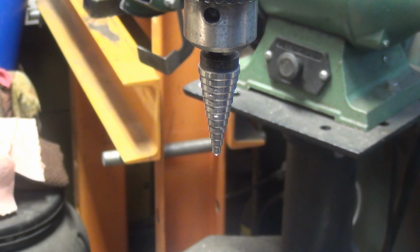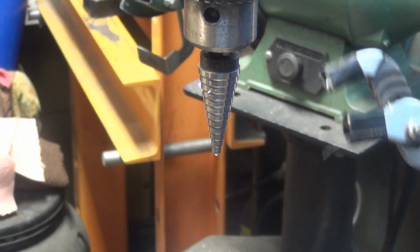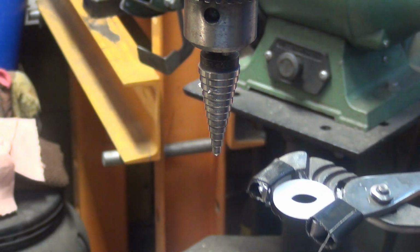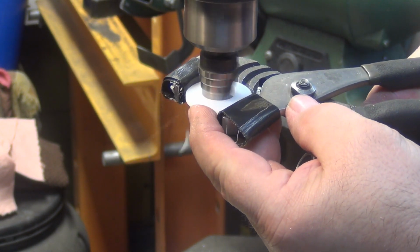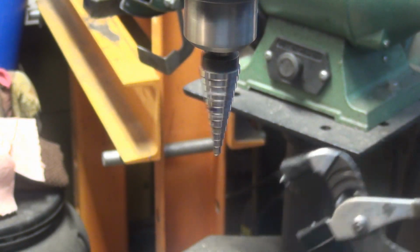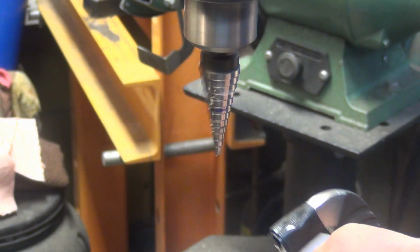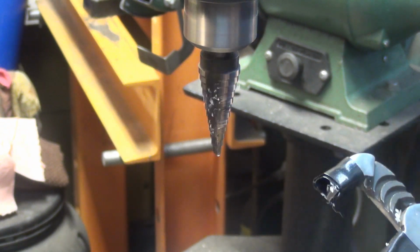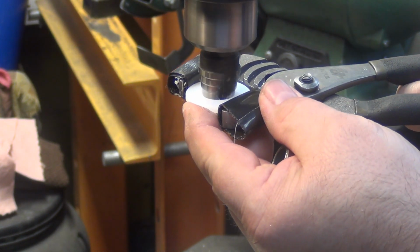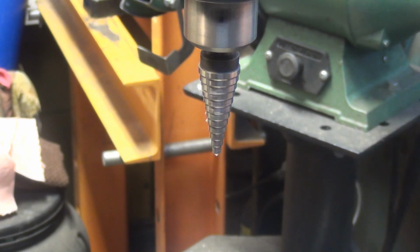Well, I had a bunch here, handful, probably at least 20, that I needed to resize. And I found that I had a step drill that was sharp enough to actually do it. And so I'm using the same plier technique, just walking it up on the 5/8 there, and I can slip that through. It's probably good. And in a lot of cases, the chamfer came out big enough with that other tool that I don't have to go back and re-chamfer the other side.